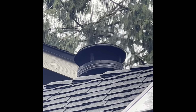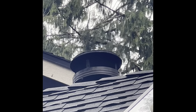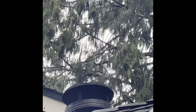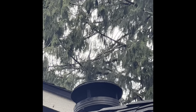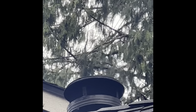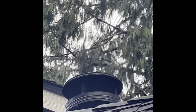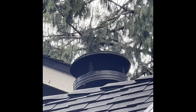One other thing you can do to confirm that everything is burning hot is come out and check your chimney or your flue and see if you can actually detect smoke coming out or if you can just see the convection currents. As you can see here there's no visible smoke — you can actually see the convection currents or the heat coming out, and that's a good indicator that everything is combusting fully and reaching adequate temperature.